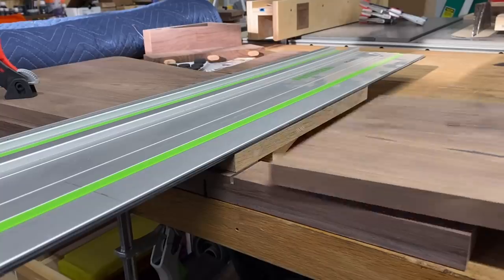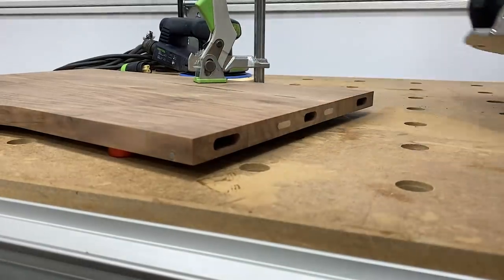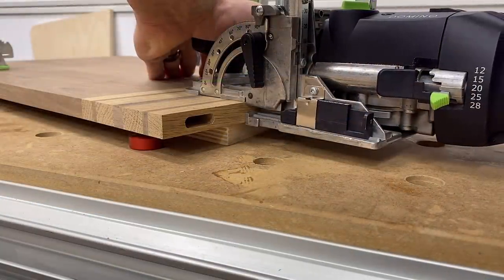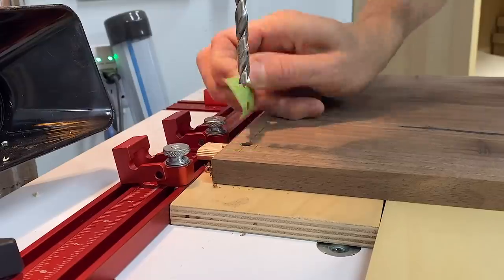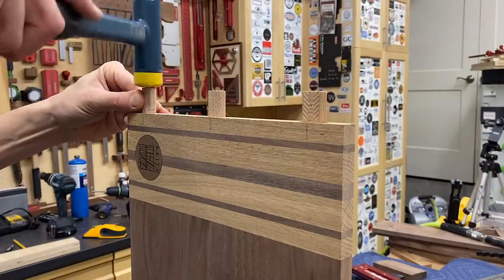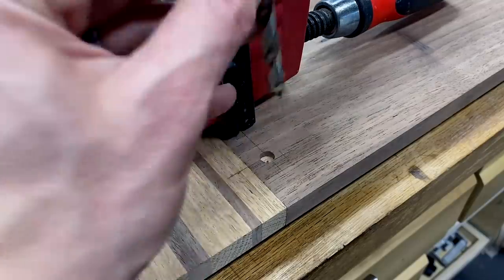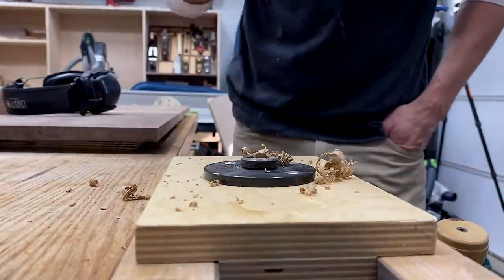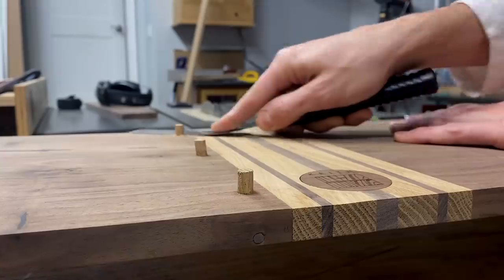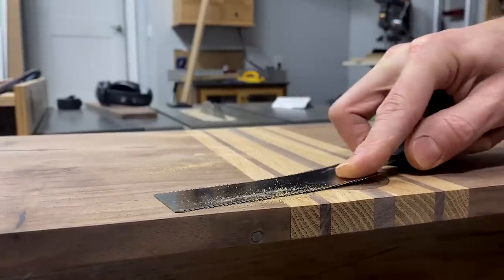And here's where the painful repair process began. I lopped off that one end, re-mortised my dominoes with the outer ones being elongated on the loose setting. Same thing on the white oak section. And I laid out for my holes to drill for the draw bore. Now I am only gluing in one side of the domino — in the walnut side, those will float except for the center one, which will be solid. And that will allow for wood movement from the center outwards. I offset the hole locations roughly one thirty-second to one sixteenth of an inch, made my own dowels. And when I drive those dowels home, that will essentially bend around that offset and pull that joint tight together. And then I can cut them flush and flick them with reckless abandon.